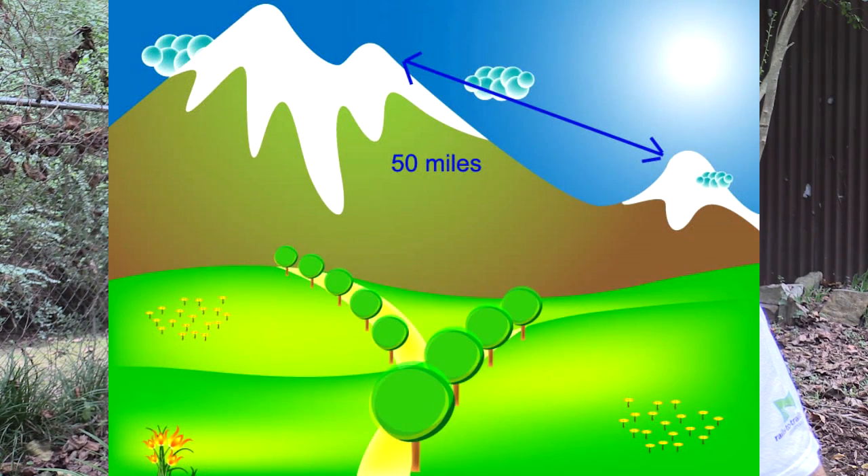If I took two of these talkies and went on a mountaintop of any height — say 500 or 1,000 feet — and put an external antenna on this, a little 2-meter beam, going between two mountaintops, I'm sure I could do 50 miles with 4 watts. That shows you it's very dependent on your elevation above ground — that's the most critical thing — and the quality of the antenna, not the power.